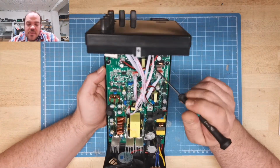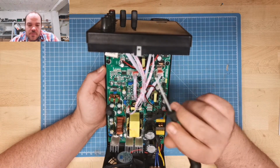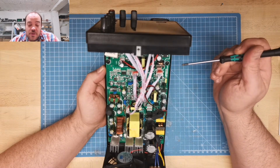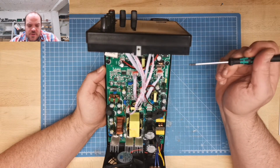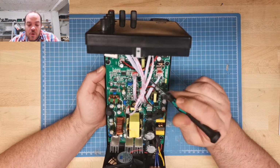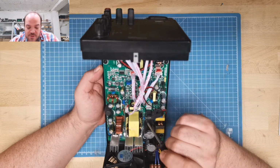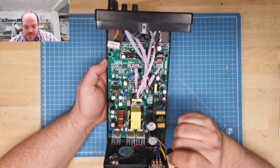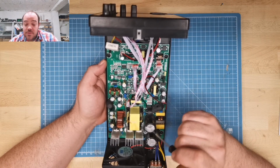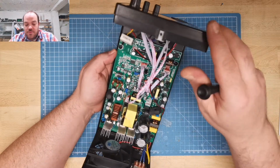So this looks like a secondary switching power supply just for the display in the front, because of course when it goes to current limiting, putting down the voltage, whatever, you need power for this, and this looks totally like a separate one. I see some separations in this area. I see something on the big caps that looks like bleeding resistors. Input voltage comes here. It has some input protection.